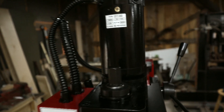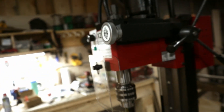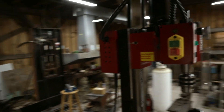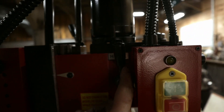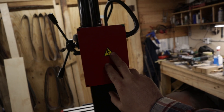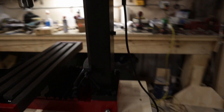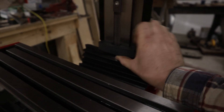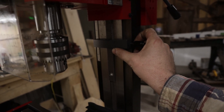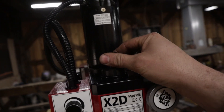We're going to be changing over to the belt drive probably within the next month or so. There's also a circuit board in the back that converts AC to DC for the motor. There's a depth stop for the Z-axis travel, which is handy for multiple repeated processes. It came with a Jacobs chuck, which is nice, and for taking that out there's a rod stopper and a 17mm wrench included.